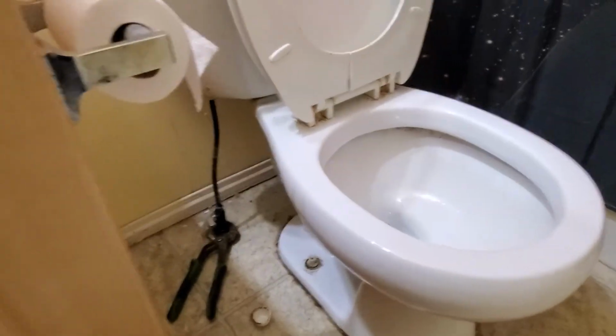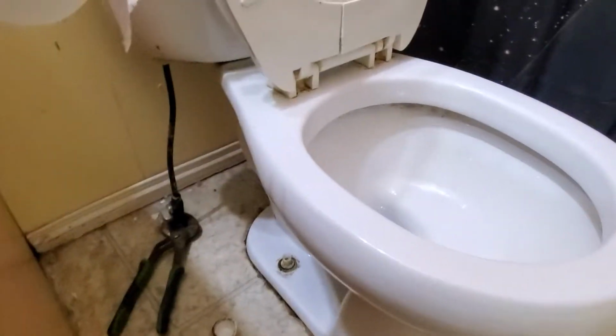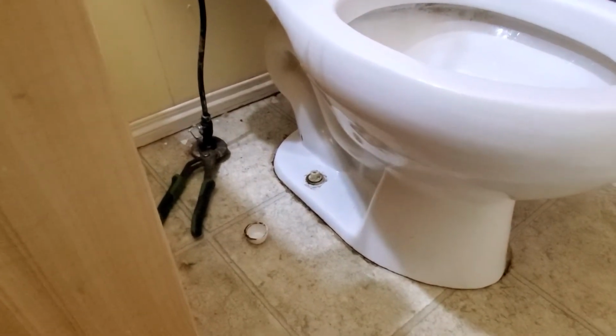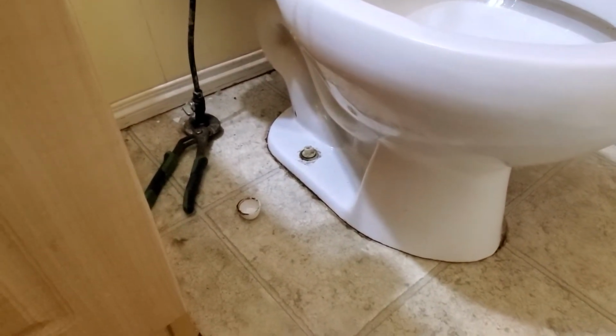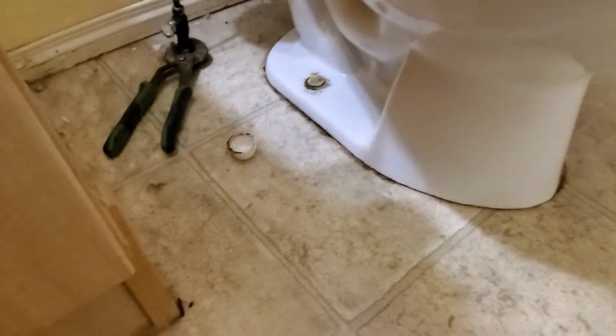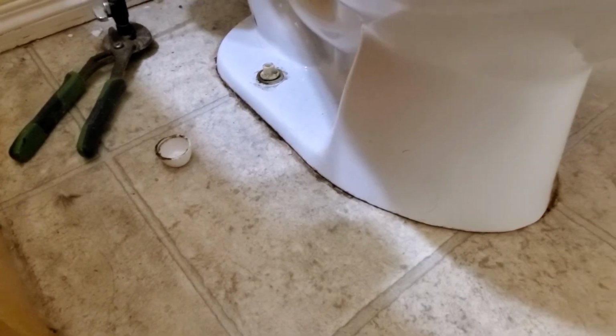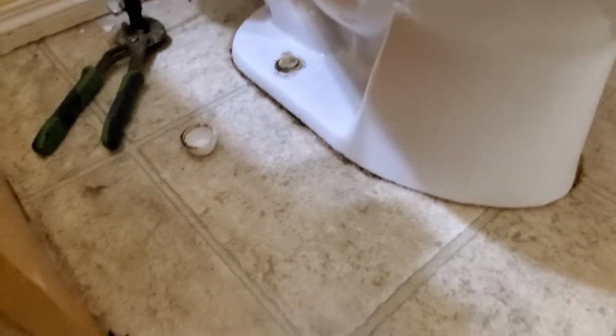I always encounter this kind of problem here. So this wall is what's leaking under the ceiling there in the living room. The reason is the plywood here, there's a bump here. I don't know if you can see the bump. There's a plywood under this lino, right? And that plywood, when it's wet, pops up. It's easy to damage this kind of plywood.